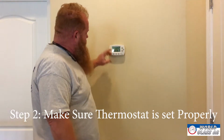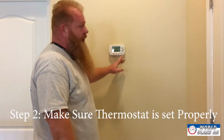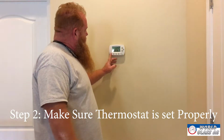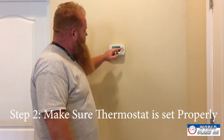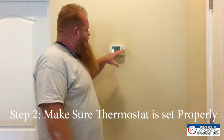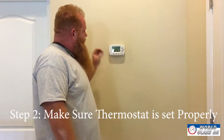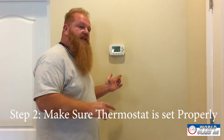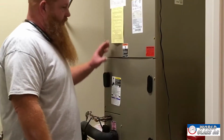The first thing you wanna do is make sure you're in the auto mode. You could be in the on mode, and all that means is your fan will run continuously. And you want to make sure that you're in the cooling mode and that the temperature is lower than obviously the ambient temperature in the space. If all of that is going and everything looks good like it normally looks when you operate your thermostat, then the next place we want to go to is the air handler.